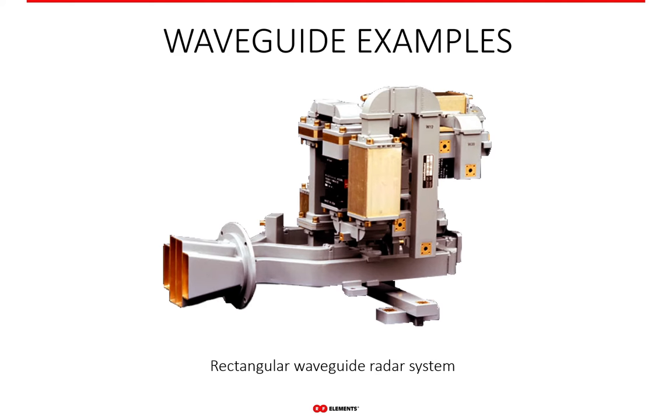This is how a device based on waveguide technology looks like. There are quite a few rectangular waveguide sections ending with small horn antennas, and in between these are parts of the device such as amplifiers, filters, and so on. You can see these devices between the gray pipes, which are the waveguides.